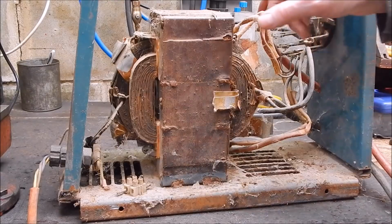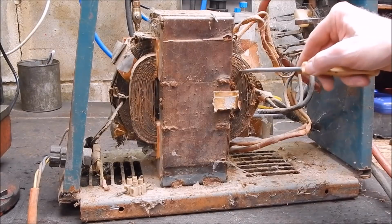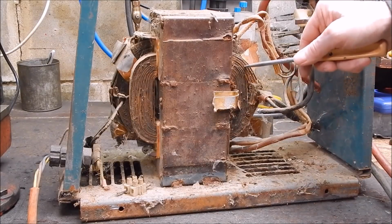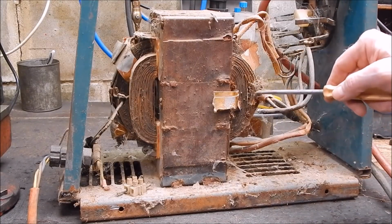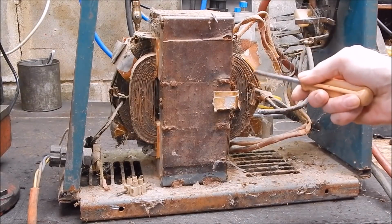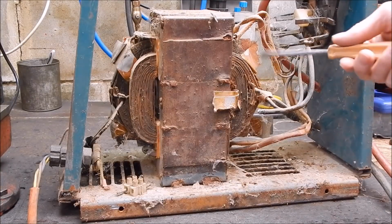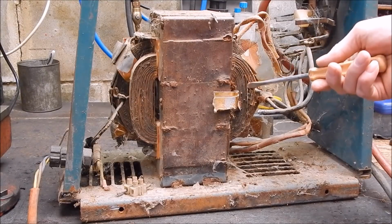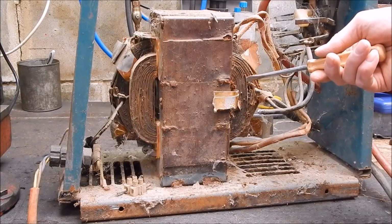She's pretty ancient, look at it. I mean, wow, this thing is really old. So there's quite a bit of copper in this old girl. I think, yep, it's copper strap, actually. Interesting. They do use copper on the really high quality ones because it gives you a better duty cycle. You can overheat copper to hell, whereas aluminium will melt away long before copper breaks down.